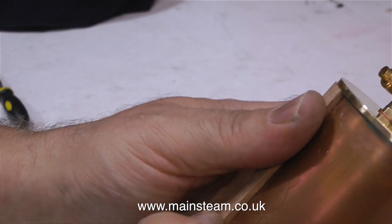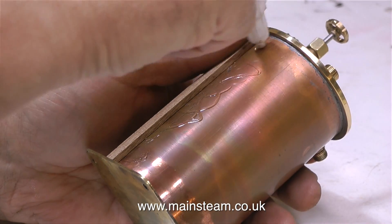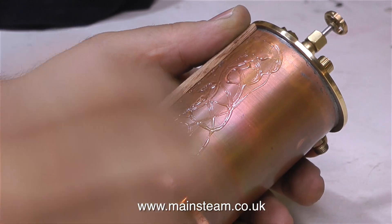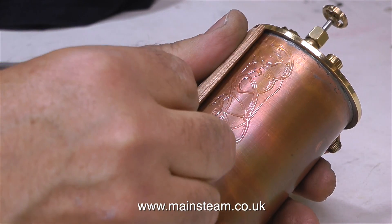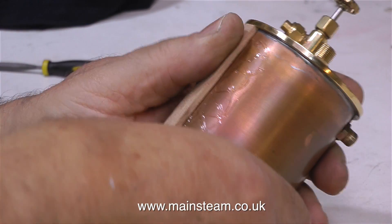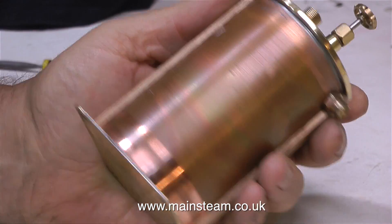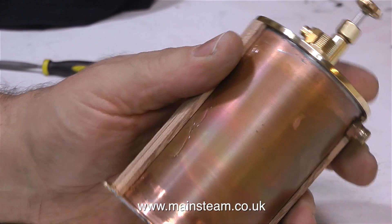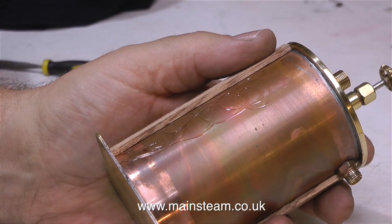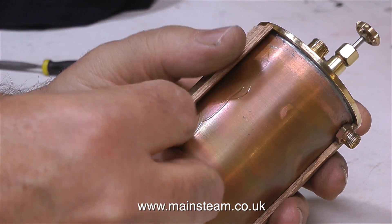When I fit this mahogany strip wood to a boiler and steam it, the mahogany moves around a little bit and then generally shrinks. The good thing about cyanoacrylate adhesive is that it gives way very easily once the pieces of metal it's stuck to have been heated. As this part is a steam condenser, it's going to be contracting and expanding frequently, which actually breaks the bond with the metal. But generally, if you take the cladding off, it comes off several pieces at a time and retains the shape. What's interesting is that once I take off those several pieces, often I can almost fit a full piece of strip wood in the gap — it's really surprising how much the mahogany strip wood actually shrinks.